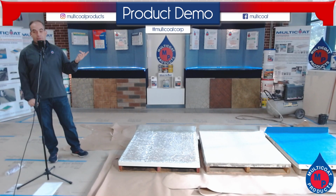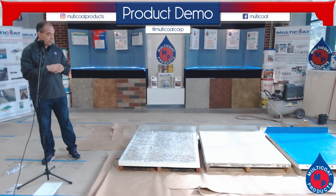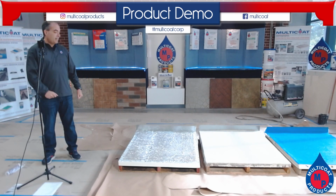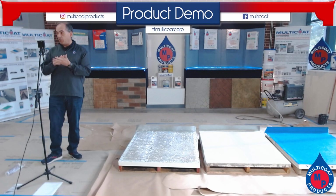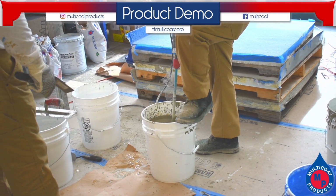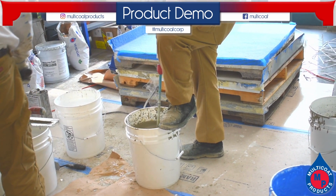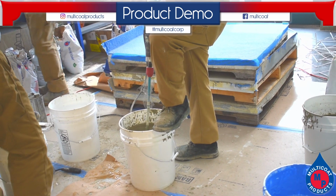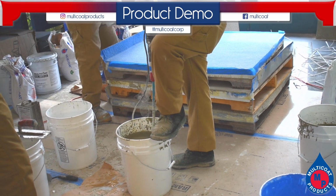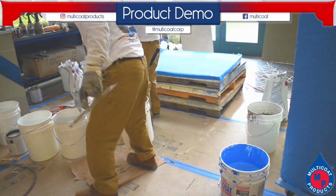And what he's preparing right now is our Multi-Base product, which is a cementitious product that you basically use to fill in all the cells of the metal lath and cover the metal lath. Multi-Base, because it has to fill all those cells, comes in a 65-pound bag, and you'll get about 40 square feet of coverage per bag. Again, when you're trying to figure this out, we have our material estimator on our website that can help you determine how many bags you need.